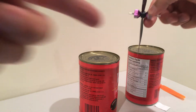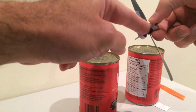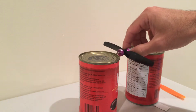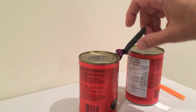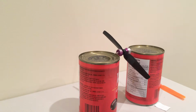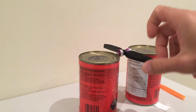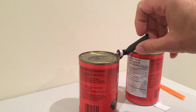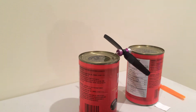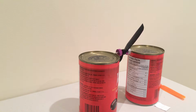And it looks like, to me, it could be this side. There's a production protrusion here where they injected the plastic. This might be the heavier side of the hub. I want to test it, and the heavier side of the hub will want to go down. That's what it's doing right now. So if I place the heavier side of the hub up here, it's going to want to find a way of getting down to the gravity. If I put it here, now it's staying, put it here, see, it wants to pull this down. So that means it's just a tiny bit heavy. If I do this, it should go down again.